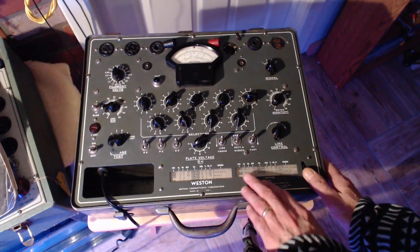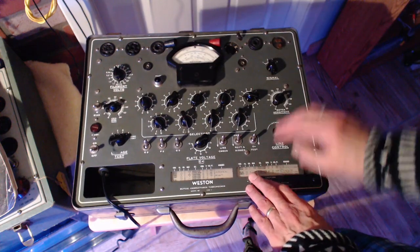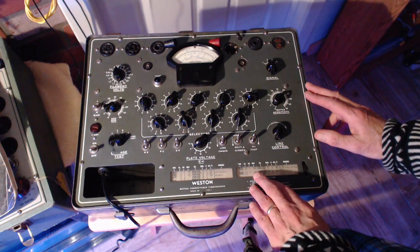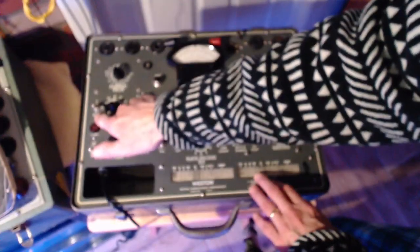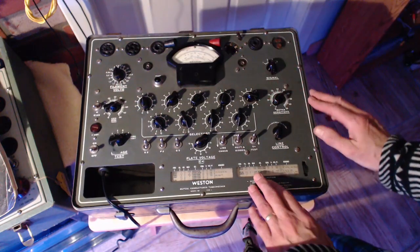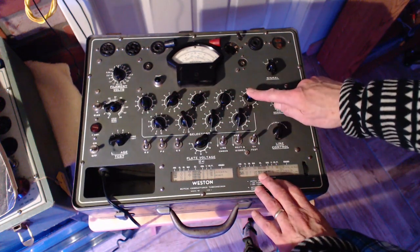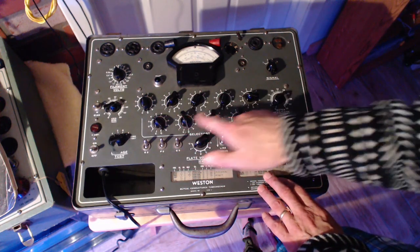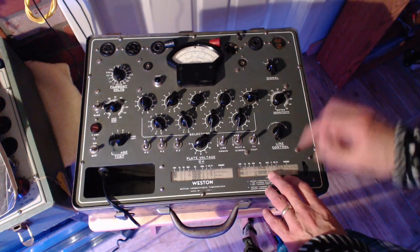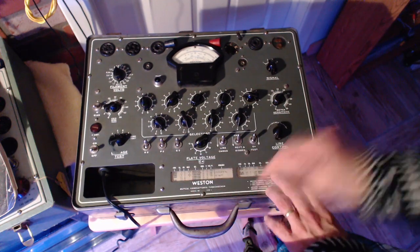So if these tubes were identical, the settings would be identical. Nothing would change. So it's the same voltage, obviously. In this tester, they want a higher signal level for the EL95. Now, the bias 16H. So you see it's on H, it's up much higher. 16 is way down here, so about double, whatever that means. In reality, 51763, 51763, these have to be identical. 4G00, 4G00. So the pinout is exactly the same. Meter sensitivity for the EL95 should be 38. Here it's almost the same. It's 33 here. Half, of course, same plate.